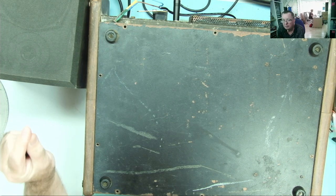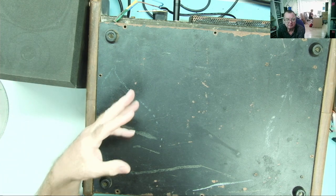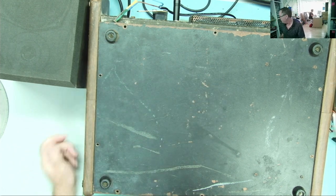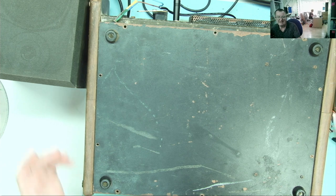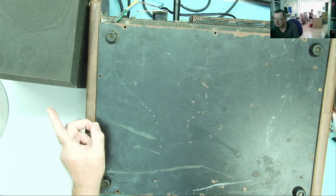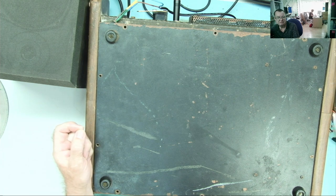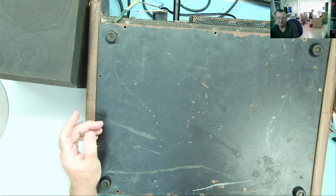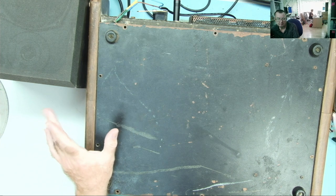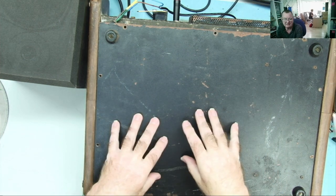Now, what I've tried doing was switching the power off, because if I switch the mains off, then effectively the power supply, you know, the bridge rectifier and so far isn't putting power in anymore, but there should be some power in the supply, if you know what I mean, for a few seconds, and listen what happens. Do you hear that? So the hum stops when I switch the power off. We continue to get the hiss for a little while, then it goes off. Again, on. Do you hear that? So the hum is definitely coming from the mains supply into here, that is for sure.